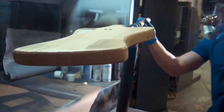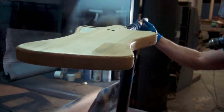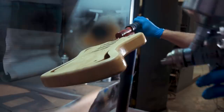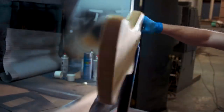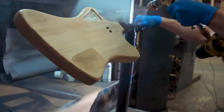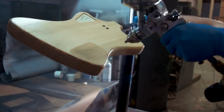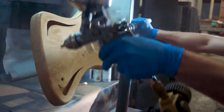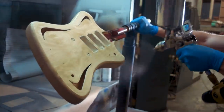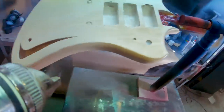You may have noticed I have a camera mounted right to my gun here, because apparently I thought it would be a good idea to take some footage right from the gun — to make you essentially motion sick as I show you a point of view that nobody would actually have when spraying. I'm doing my three coats here and I'm going to let this dry overnight so I can come back and sand it the next day. If you want to really go on the safe side, or if you're using a lacquer sanding sealer, I would suggest giving that three days to dry before you move on, just so you're not dealing with any risks of it not hardening properly.